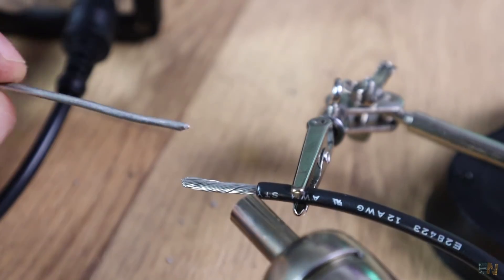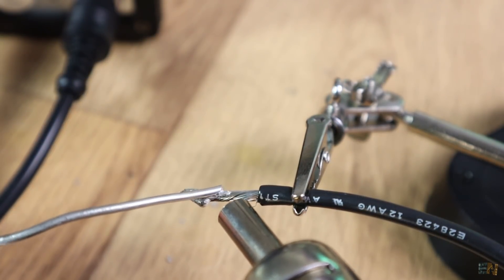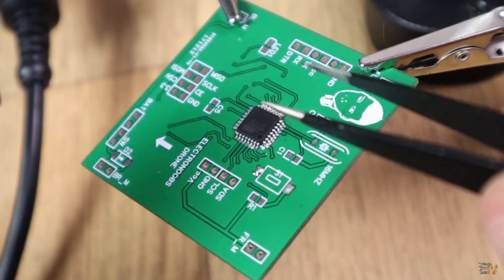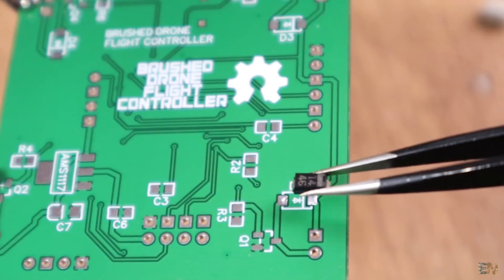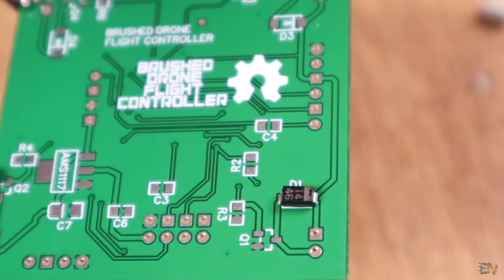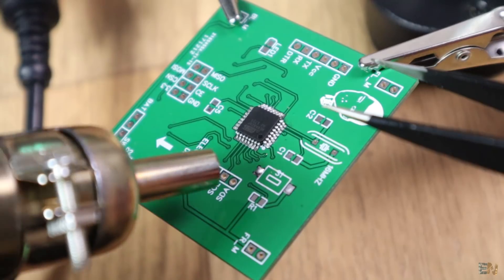You can also tin copper wire very fast — the air comes out at over 400 degrees. Just hit the wire and apply solder, or dip the wire into solder paste and then hit it with the gun. Working with solder paste is more than easy. If you're building boards with a lot of SMD components, just put paste on each pad, place the components with tweezers, and then heat the solder paste until it melts — this is called reflowing. With a basic iron you wouldn't be able to do this, and it saves a lot of time when creating multiple boards.